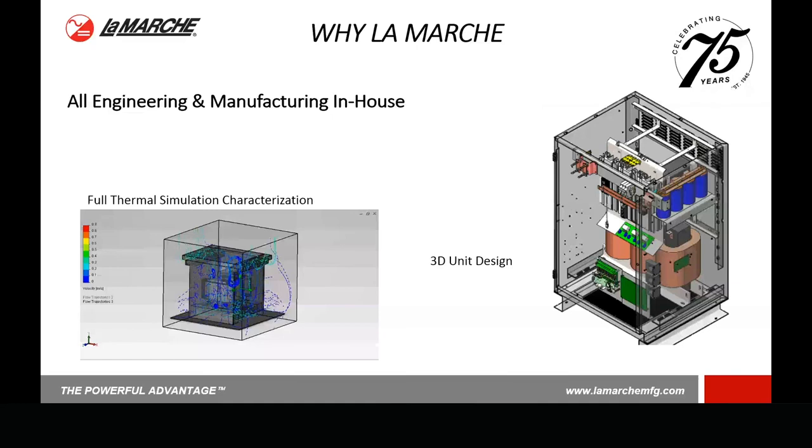On the mechanical side, these days we do everything in 3D modeling — you can see that off to the right of the screen. That allows us the flexibility to optimize product designs and reduce production issues ahead of time. Engineers can physically look at a model and see if there's an interference, or make sure that products are user-friendly — for example, can a customer get to the terminals? Are they in an appropriate location? With the software we can also do thermal simulations to make sure the enclosure design isn't going to overheat, or that ventilation holes are placed properly.